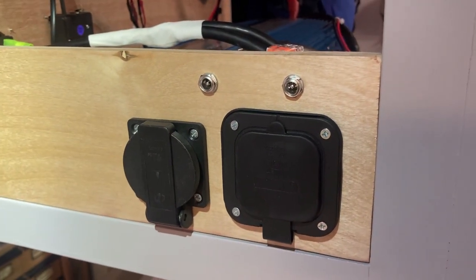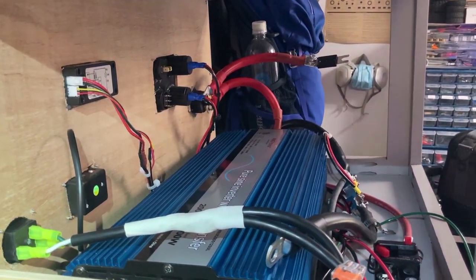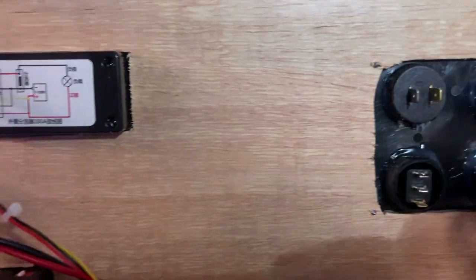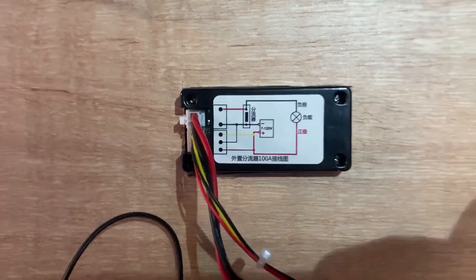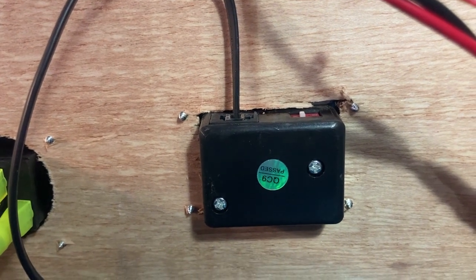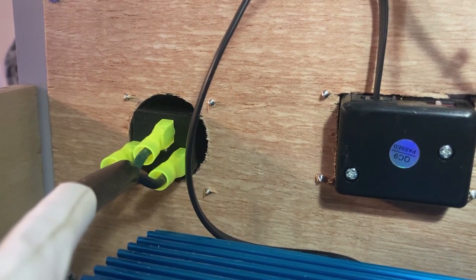Here are the two AC and two DC connection points. One AC plug is for power to the big drone charger and inverter passed through. The other AC plug is for power to the Apex controller. The two female barrel connectors are used for power to the DC backup pumps when the inverter drains the battery lower than 12 volts DC. This is an integrated DC panel that is partially wired in using 12 AWG DC-specific silicone wire to make the connection to a central fuse block. You can actually use copper speaker wire for low-voltage DC connections if you already have it laying around. Right here is the back of the amp draw meter and this is the remote switch to the Ames inverter — it's handy to have all controls mounted to the front panel.